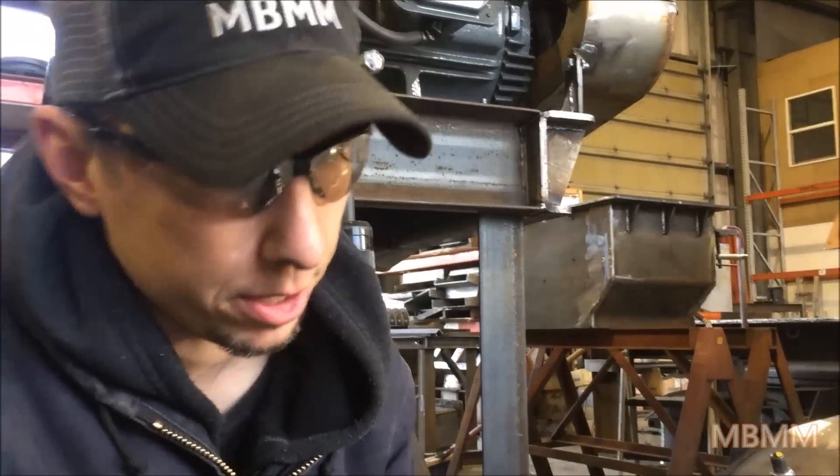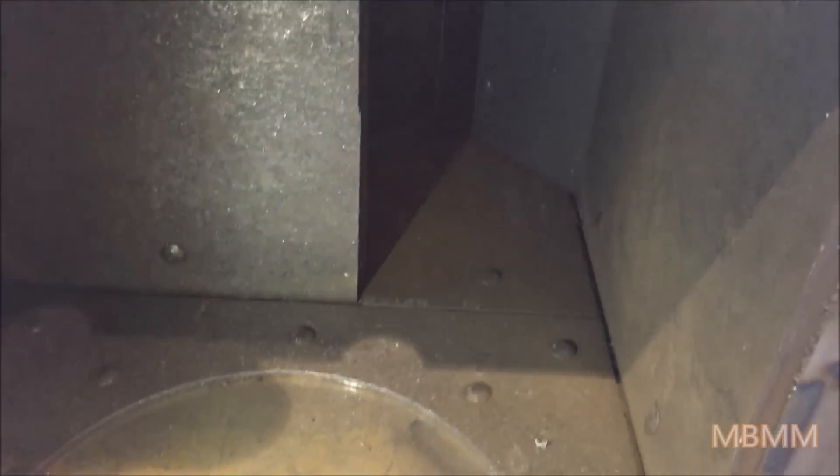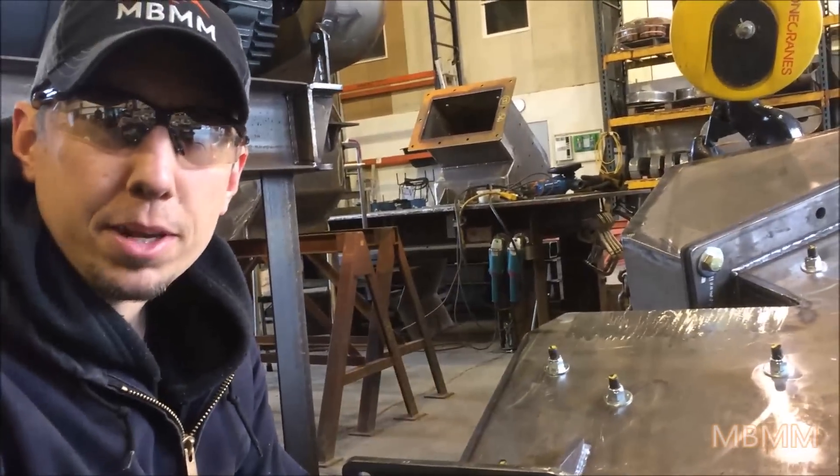There's the inside of the mill. Looking inside the top of the hammer mill, this is the lid. There's a breaker plate on the front and a breaker plate on the top that's three quarter inch AR steel, and all the surrounding armor is three eighths AR steel. It's got armor all the way around the inside of the mill, both on the top and the bottom of the case.